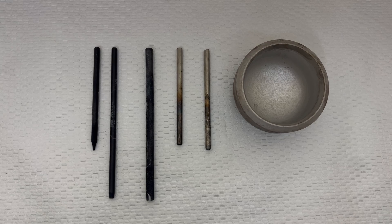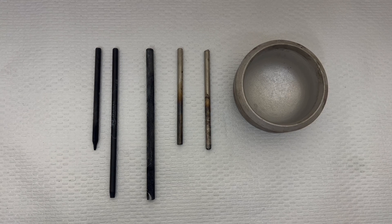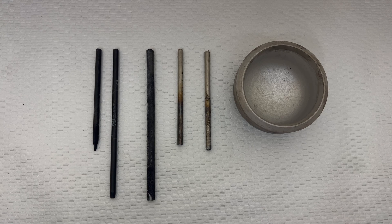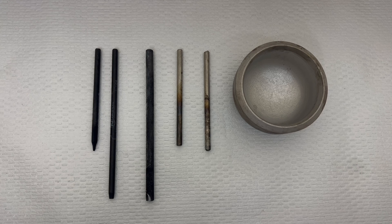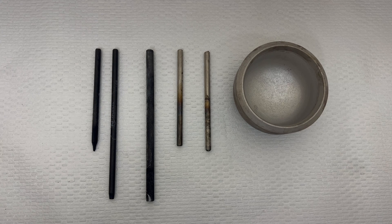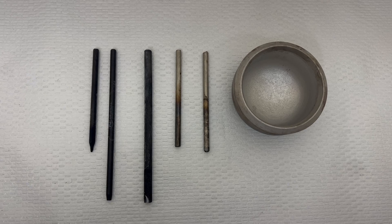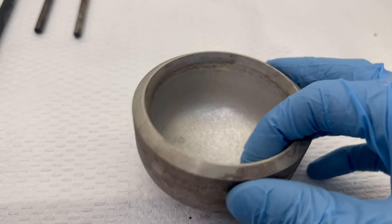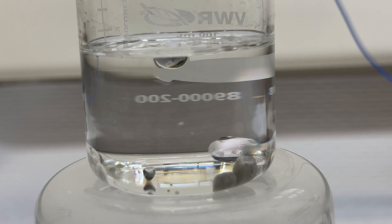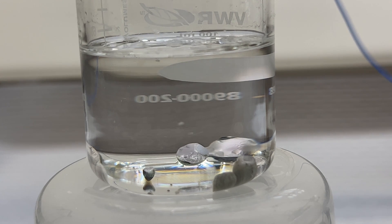After cleanup, we can take a look at the pipe cap and electrodes to see how much damage has taken place. The arc welding electrode that was used is significantly shorter than the unused one. The non-arc-welding carbon electrode is not as damaged, but graphite was already flaking off within a minute of use. Comparing those to the nickel electrodes is a stark difference — the nickel electrodes held up quite well, with only a slight nick in one. The pipe cap took pretty much no damage; you can still see the manufacturing marks. Thank you for watching — check out the links and references in the description for support and more videos on this topic.